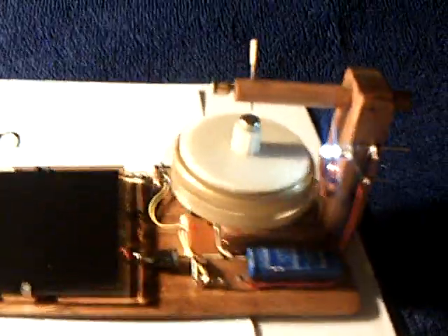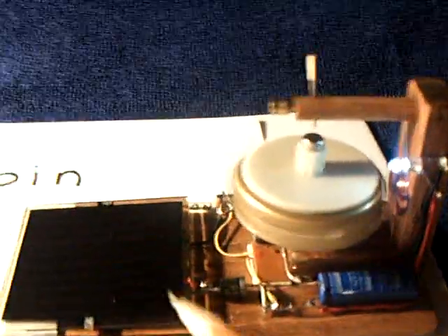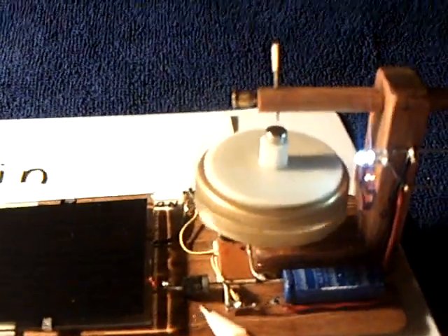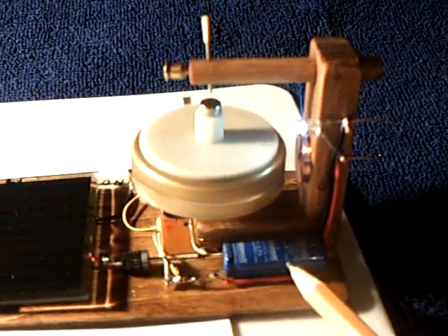These are little drive units that come out of solar-powered toys. I hooked it up with a solar panel — a bigger one, much bigger — with a blocking diode, and then a 10-farad, 2.7-volt supercapacitor.